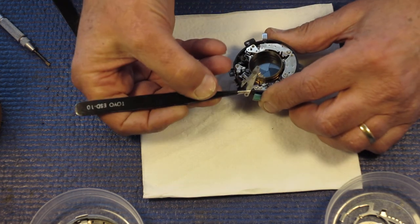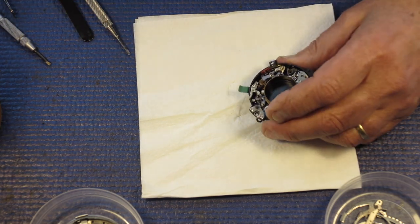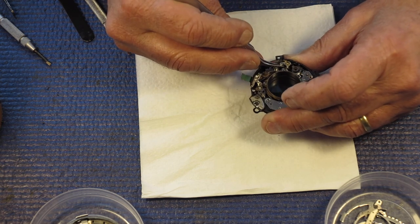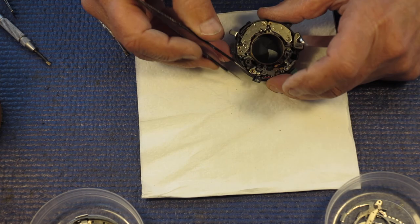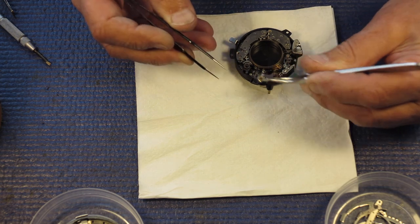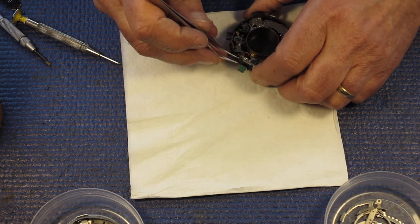Let's get this cover off. There's your flash contact — I'll just release the tension from there. This little piece should come out. A bit reluctant to come up — I think someone's been bending things. This little tab here, which serves as the other end of the flash contact, somebody has helpfully bent it out so it's catching things where it shouldn't be. I've just got to push that back out of the way, then I can lift that component past it. As I said, someone had been into this shutter before and they had their own way of doing things.